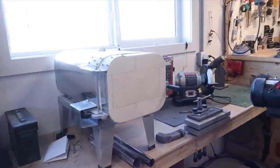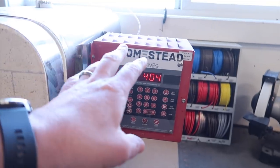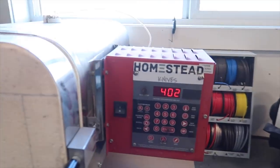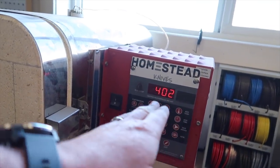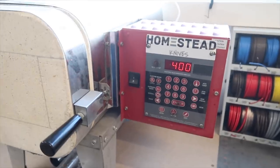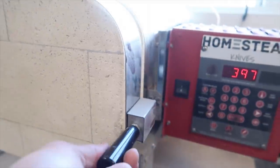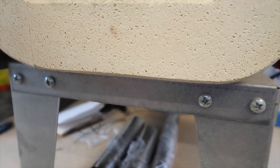I've got the kiln fired up and we are ready to go. One tip I always follow: make sure the kiln comes up to my tempering temperature before I put the knives in. One time I thought it was on the tempering program but I was actually on the heat treat program — I put the knife in there and basically ruined all the work I had done on the heat treat. So I take this off, put these in, and by the end of the day we'll be ready to start grinding them.